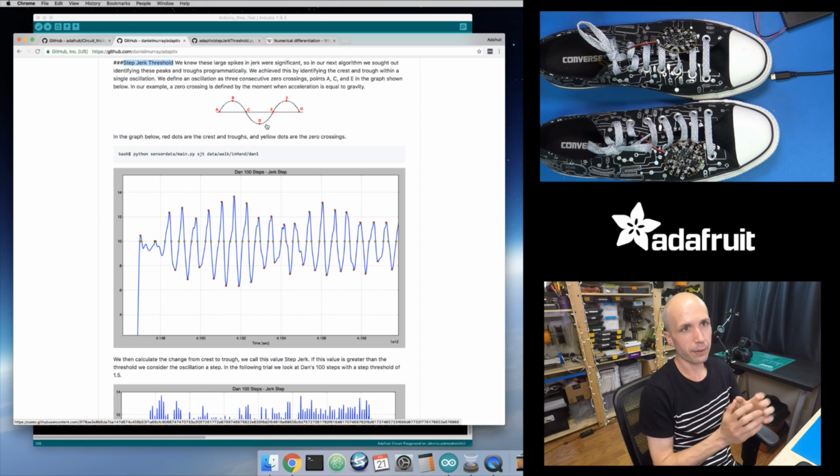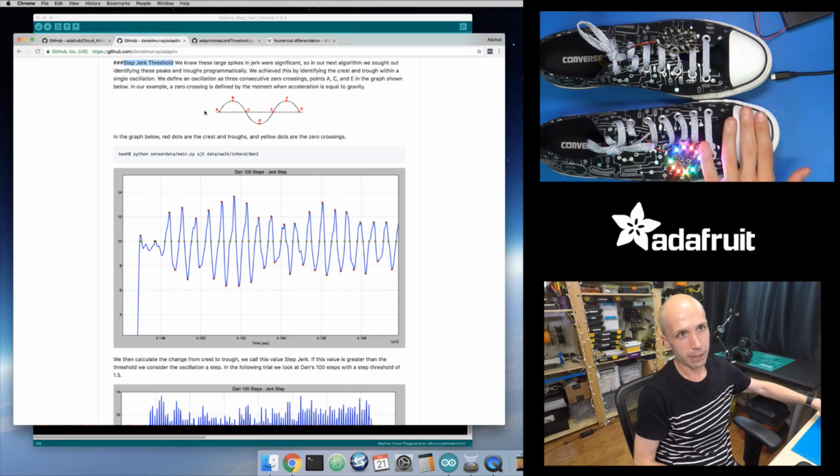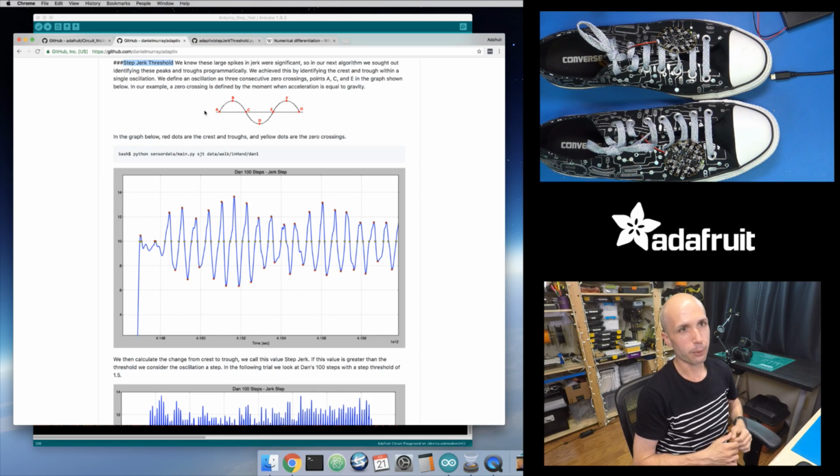So the thing is figuring out when am I in this peak period versus when am I in this trough period right here. And then one question is, well, first of all, how do I know the difference between peak versus trough? What is this baseline value? And so they actually talk about the baseline being just gravity, just the force of gravity, with the shoes sitting on the bench like this, and with me not touching them and applying any forces, just gravity is pushing down on them with the force of 1g. And so for me, my baseline value is 1, 1 force of gravity with no movement at all. Just standing still, I should see just 1g down against my sneakers.